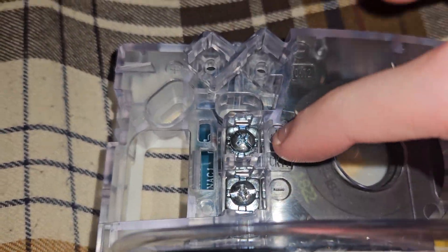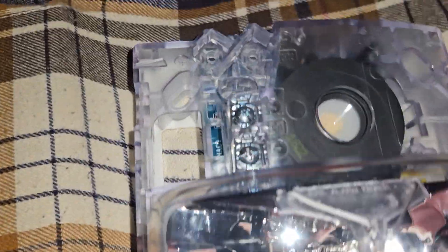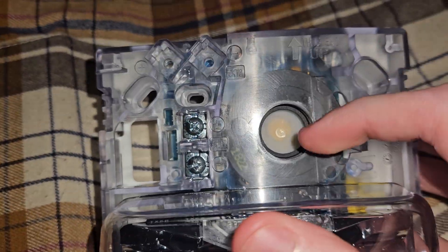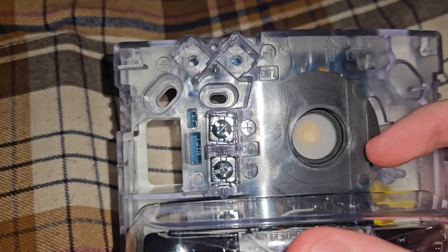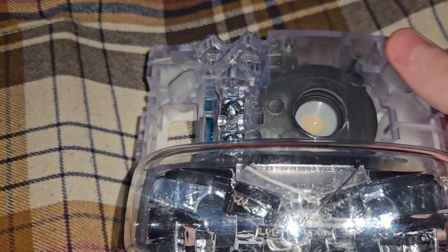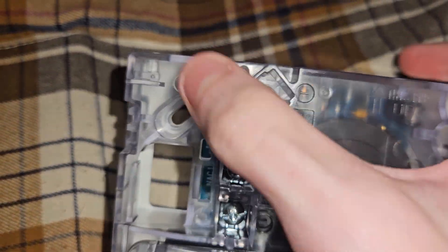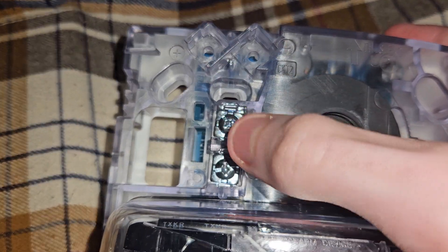The multi-tone ones do use this same piezo type, but they're different colored and different shaped overall. Here are your terminals — positive and negative. It is a two-wire device because this is a SmartSync TrueAlert. The free-run TrueAlerts — like the 4903-9425, 9426, 9427, 9431, 9432, and 9433 — have four wires for the strobe and the horn.